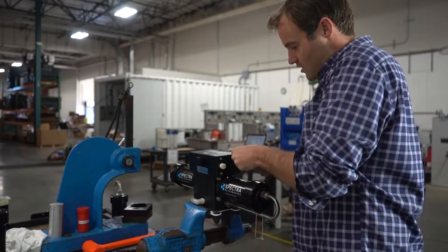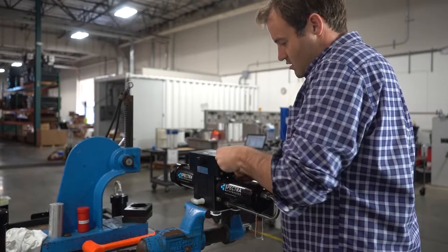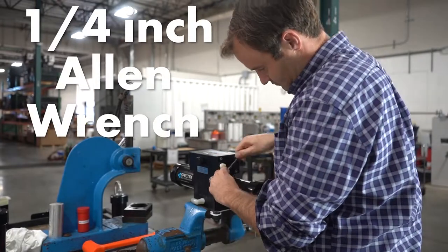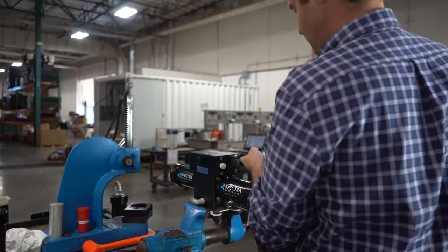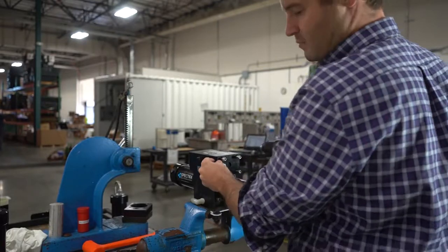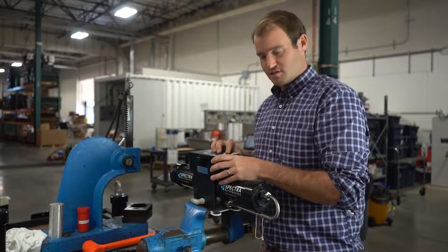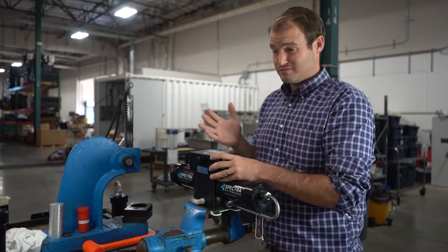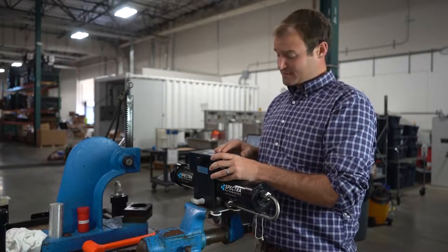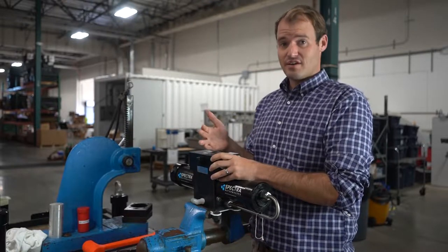First I'm just going to break the torque here with my Allen. Now if your Clark pump is less than three or four years old, you could probably just get in here with just the port seals. If it's older than four or five years, you might want to have replacement seals for here, because anytime you lift off a block the O-rings might be flat and you might actually be dealing with a secondary leak once you put them back together.